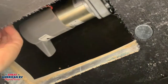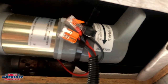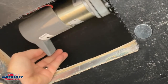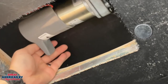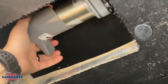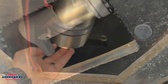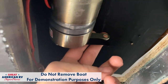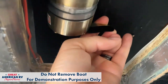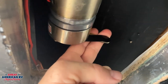So you can see here we now have access to our motor, and on it you'll see a sticker right here — it says 'release' on this side and 'engaged' on the top side. This is for our motor brake. We have a lever inside of here with a little tab — a safety tab that keeps that lever from being knocked accidentally. I'm going to go ahead and remove this boot just for demonstration purposes; I don't suggest you remove the boot, this is just to give you a better idea of what you're looking at. So we see here we have access and this is our lever. This is our safety latch right here. This safety latch would be pulled towards the motor, and then at that point you pull that lever down and that releases the brake on the motor.